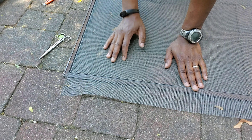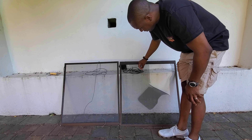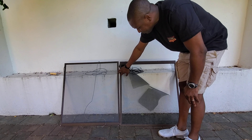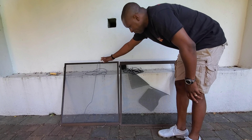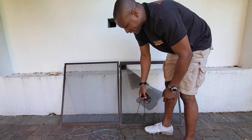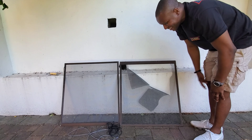This side faces outside, so I want it to look clean and not cheap. Here's a before and after — my kids ripped through this mesh, my son likes to push through it. Fairly easy to do, took about 10 minutes. Remember: keep your mental concentration when cutting and inserting the spline, because it's really easy to cut the new mesh, especially fiberglass. You could reuse the old spline, but it gets weathered, gray, hard, and brittle, so I wouldn't recommend it. New spline packs are about three to five dollars.